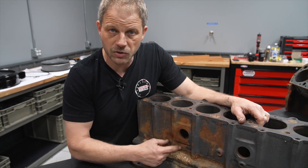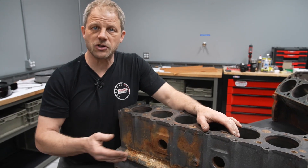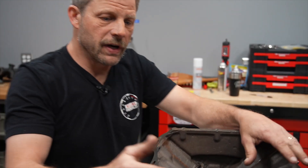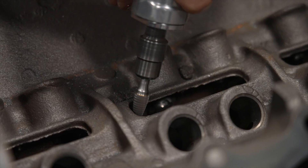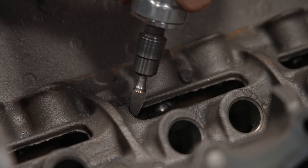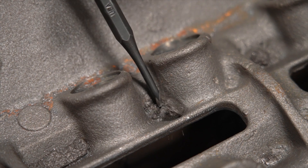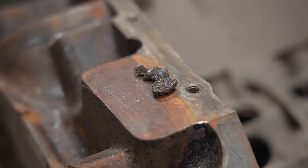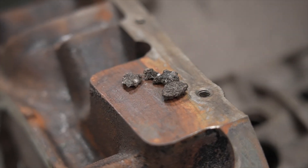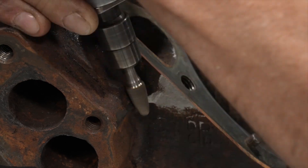There's a stitching technique with basically screws, and then of course things can be welded as well, but that's where the professional side comes in — their judgment and knowledge to lead you there. The third item I like to do before taking it to the machine shop is clean up all this casting flash. Some of it can be loose, so clean that up. Also you can see casting boogers from the casting process — big chunks. You don't necessarily have to remove those, but make sure they're firmly attached, because you don't want a marble-sized piece of cast iron floating around the crankcase. And on the outside, clean up all the casting flash so the paint will adhere better.